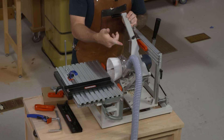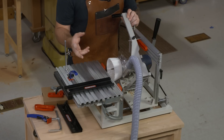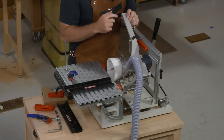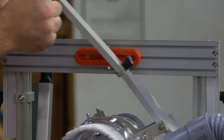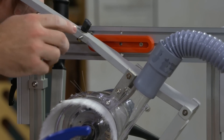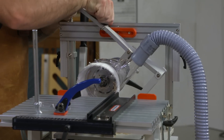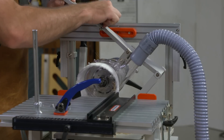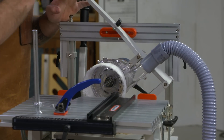When the bearing is rotated to the outside of the template to create a tenon, that outer surface is tapered. With the bearing pushed all the way back against the template holder, it follows the widest part of the template, creating the biggest tenon possible. You can test the fit, and if the tenon is too fat, pull the bearing slightly forward, bringing it down the tapered template - that slightly reduces the tenon size.